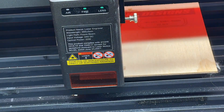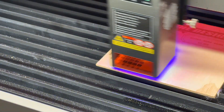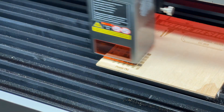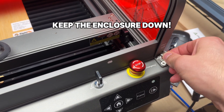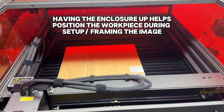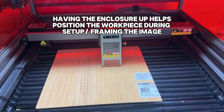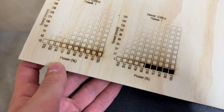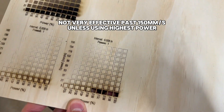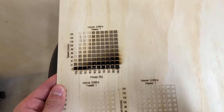Now we can finally do some engraving. In Lightburn, you can create a material test grid where you can try out different speeds and power settings to find the coloration and depth that you want. This test is one of the few clear shots I have of the laser movement — I recommend using the enclosure all the time for protection against light and fumes, though it is possible to trick the sensors with some magnets. The results on these tests will vary from material to material, and with the different settings you can see that the Falcon 2 Pro is not a speed demon, but you can still dial in the performance to engrave nicely and cut through thin plywood.